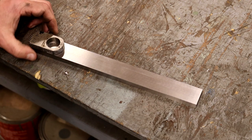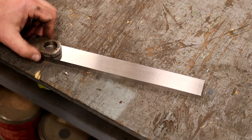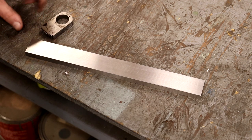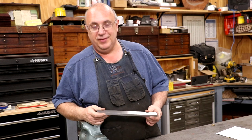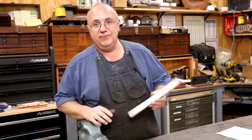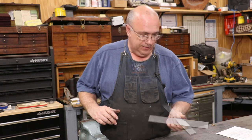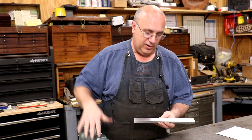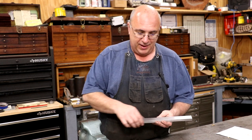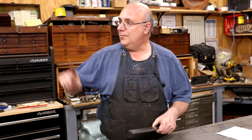I'm going to be done with this episode of the video. We'll be coming back later on to drill the hole, turn this to the proper radius on the outside, and cut those teeth — that'll be in the upcoming episode. So there you go: grinding a piece of cast iron stock to size. One nice piece of stock to work with now. We'll come back and finish this up later on — I've just run out of time, very limited time to get out to the shop this week. My plan is to make several of these parts so when I go to cut the gear teeth I can stack them all together and cut them at one time.